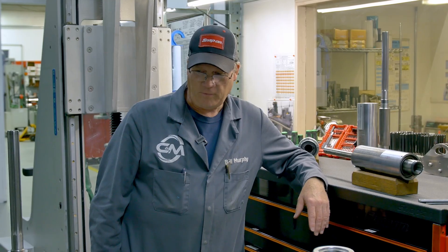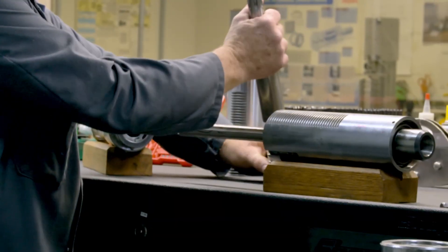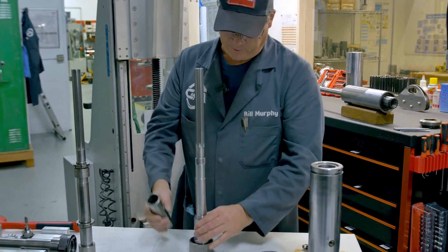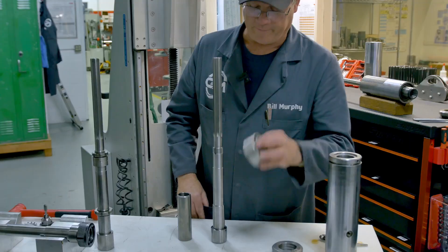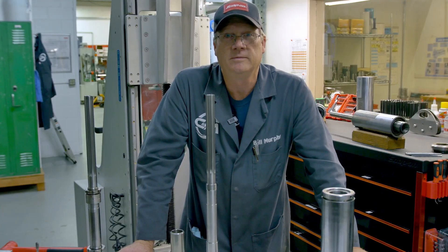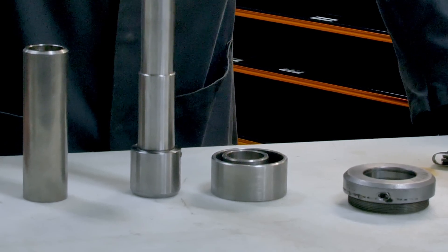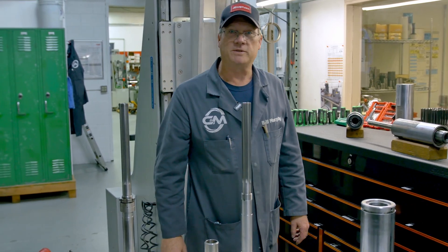The difference between three-pack and five-pack is of course two more bearings in the front. We get them in all shapes and sizes as they come in, including bare shafts with just some of the parts. The only guys that buy the three-pack bearings from me are dealers that want to get a Bridgeport running and sell it. I recommend five-pack on everything because more balls equals stiffer shafts — you get better cutting and you're not going to be breaking tool bits as often.